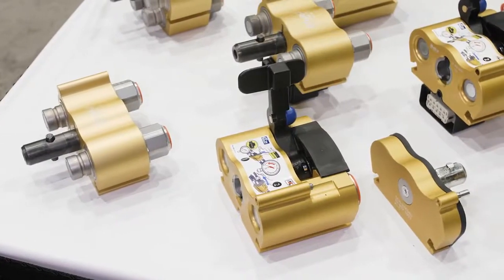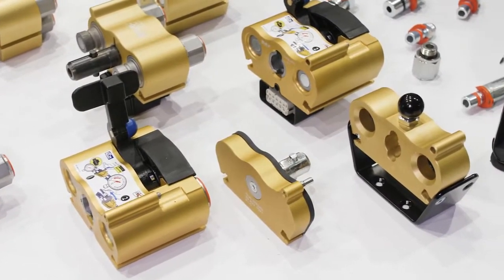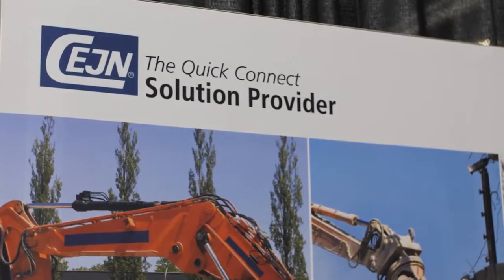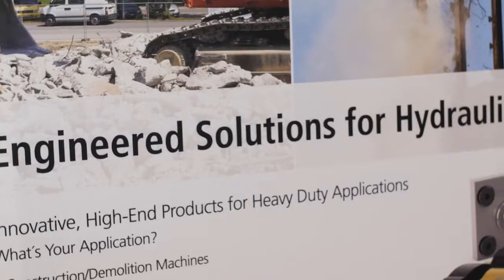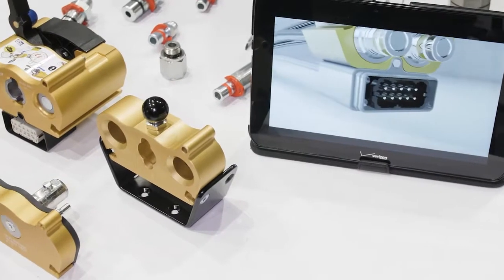On quick-connects, it's always an issue when there's stuck residual pressure on the attachment side. They take a hammer with a screwdriver to try to pop a valve open or they're cracking the line open — unfortunately putting contamination in the system. So the whole idea with the male half on the attachment is there is a secondary nipple opening which bleeds off residual pressure up to full working pressure. No longer have to fight and deal with that anymore.